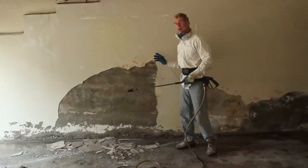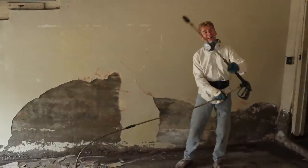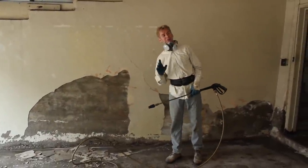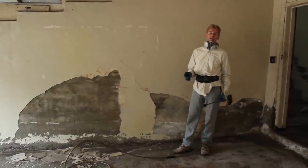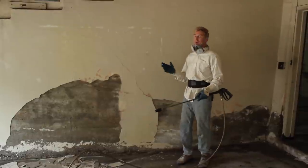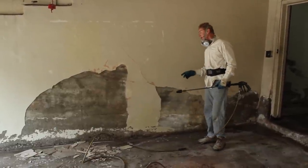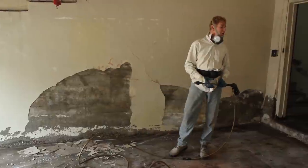We're going to do this all the way, and as fast as I pull a piece off I'll hit it with water because I don't want exposure to the dust and debris. When we get to the stage where it's all clean, we'll show you again. We're going to skim coat all this with gypsum with lime in it — a Structolite plaster or a veneer base coat. Those can get wet, and when drier conditions occur they dry out. We'll pick up all this material, throw it in special trash bags, and dispose of it properly.